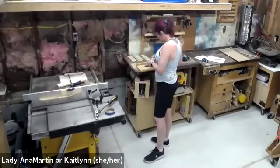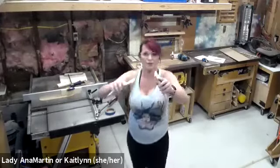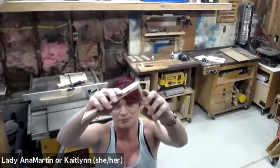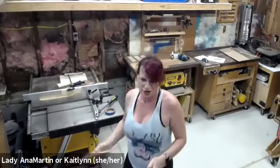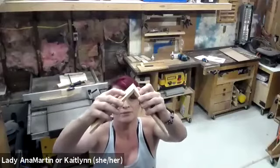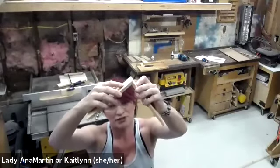Another one is the venerable butt joint. A butt joint is just two pieces coming together like that, and you nail through one side. Not particularly strong. Another one is, and you don't see this as much because it's difficult to do correctly, and I can guarantee you this one is not correctly, a miter joint, where the sides are cut at an angle. Now you can nail through both sides, so you get a little more strength, but it's still not particularly strong.